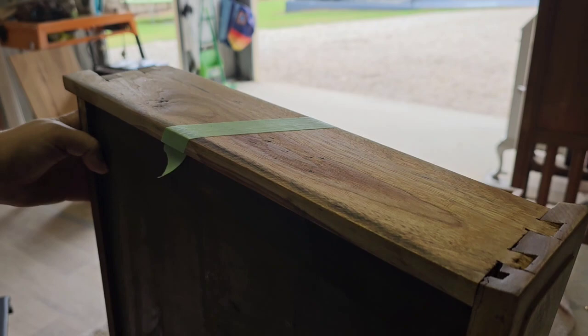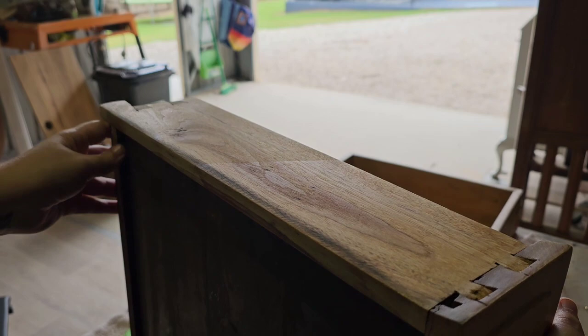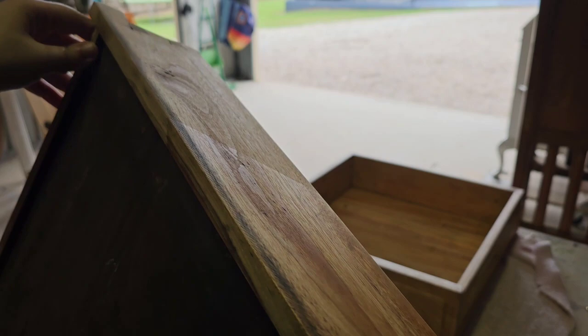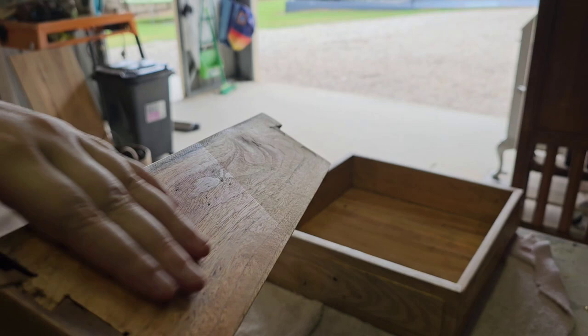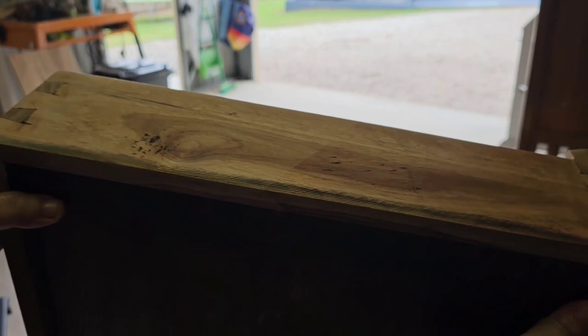So this is using the Cutz Millie hemp salve rather than the hemp oil. You can use either one of them, but obviously you can see which part of this was wet sanded and which part is just raw wood, and it makes such a huge difference and took like 5 seconds to do. So that's just wet sanding with the wet dry sandpaper and then buffing it with a microfiber cloth. Huge difference.